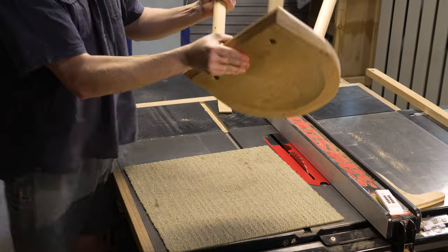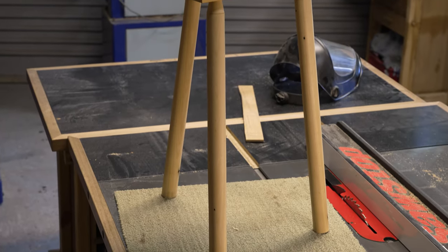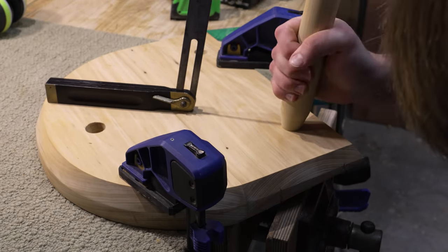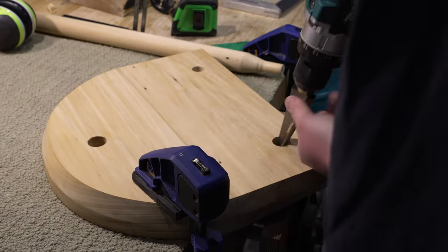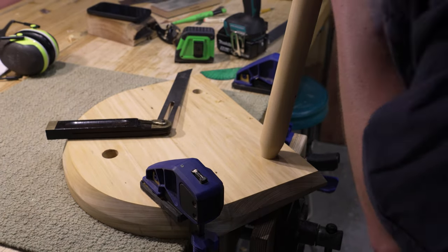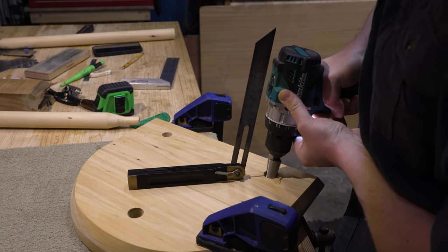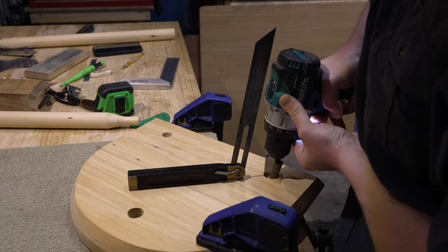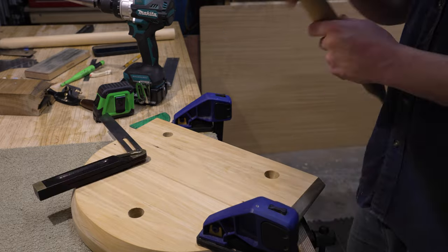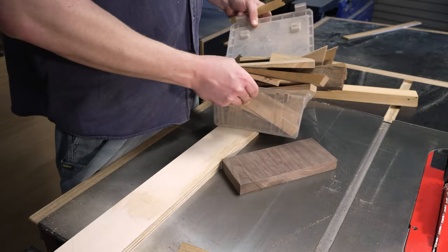So now we've got three legs with tapered tenons but we've just got regular drilled holes. Those legs fit into their holes fine, but we can get a much tighter fit by using a reamer. This reamer has the same angle that we've just put on our tapered tenon legs. By doing this you can get a really, really snug fit. The beauty of this is that throughout the stool's life, as people sit on it again and again, it just makes that joint even tighter.